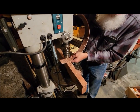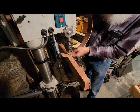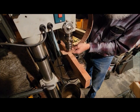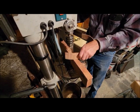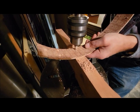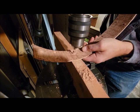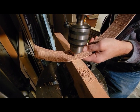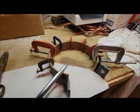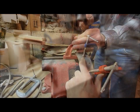We're set up in the drill press here with a special counter boring bit. We have the depth stop set, so they all go down the same depth into the brake band material. Got a piece of wood as a backer. Put the lining back on there, clamped in place with the holes lined back up. Now we're ready to rivet.